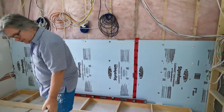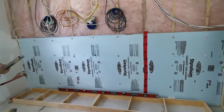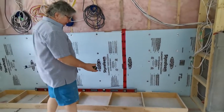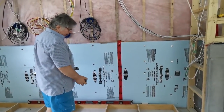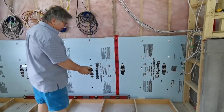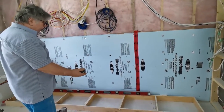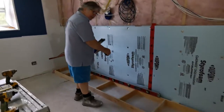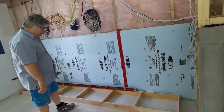I can't stress enough about ladder bases. I mean, you've heard about it or haven't heard about it. And you have regular cabinets that have a kick plate. To be honest with you, I haven't really installed them before. Because I've been working so long on my own, these are my bases and just the way I make it. But with those other kick plates, you get a lot of sag in the middle of the cabinets, and especially if you're using particle board, I think it's horrible.